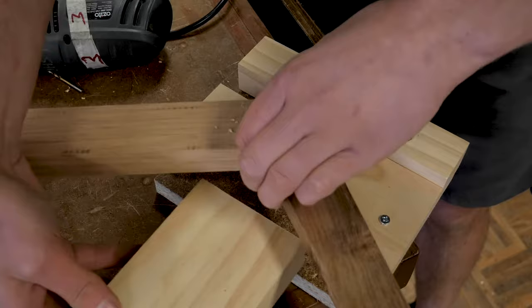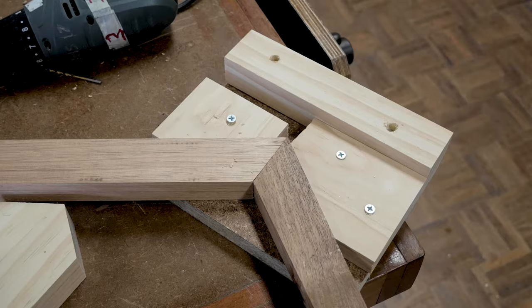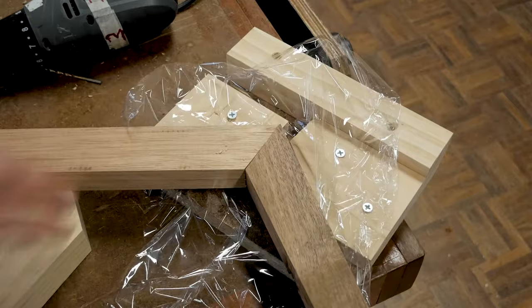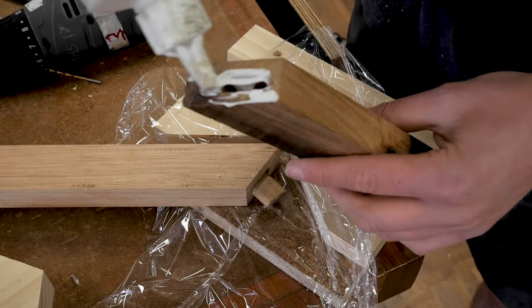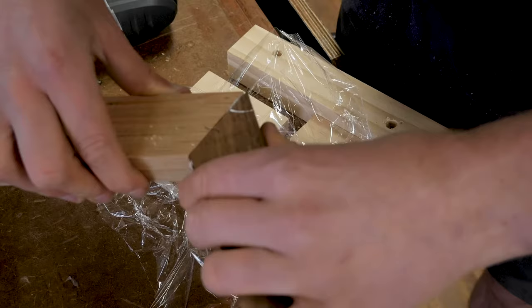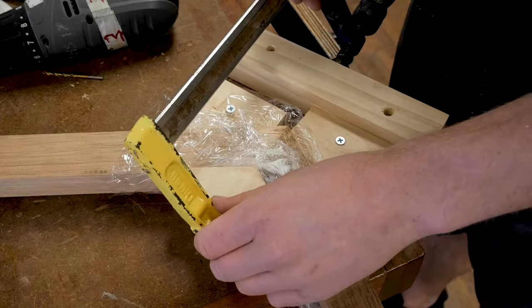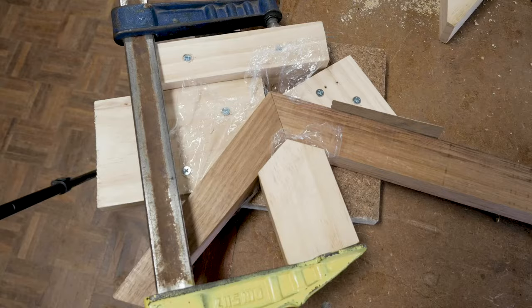As long as you've got a firm bit of pressure on it from the F clamp, trace on that inside edge, go cut it on the drop saw, bring it back in and it's ready to clamp. Again, cling wrap is the best thing to stop PVA sticking to your material. With your pressure on the clamp, you don't need a crazy amount — just lightly hold it, the glue does the work.